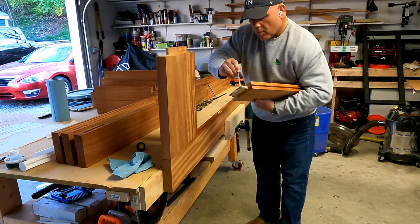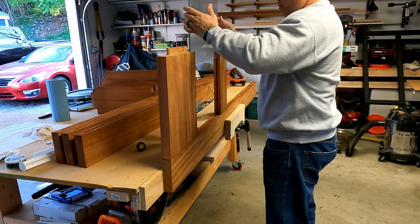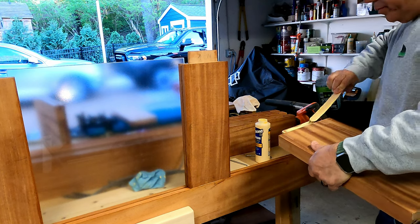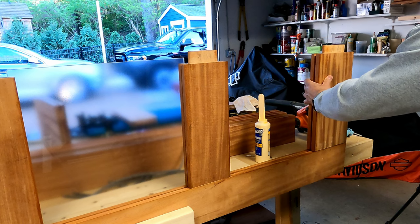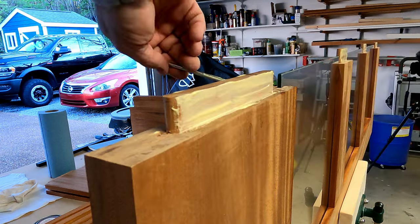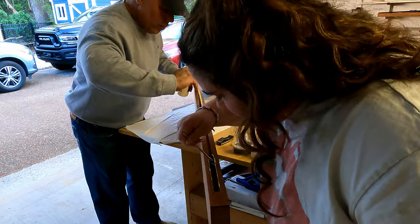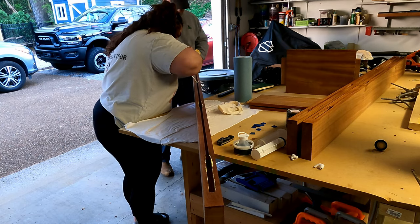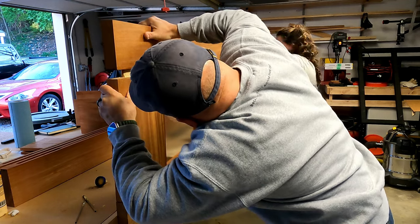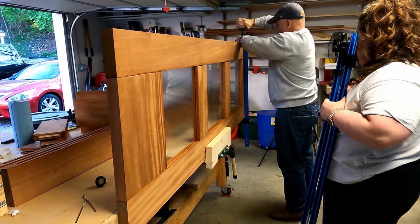The process of glue-up is pretty straightforward: make sure we put glue inside of the mortises and that we put glue on the tenons, put all of the horizontal and vertical pieces together, and then slide the glass in between each one of the horizontal pieces. Once we get the glass and the horizontal pieces attached to the bottom rail - or in this case the side rail - it's time to do the other side. Fortunately I had an excellent helper in my daughter. She came out and helped me glue, made things a lot faster, and she was able to help me with the final assembly. I used these bar clamps to pull everything together without having to beat on them with a mallet.